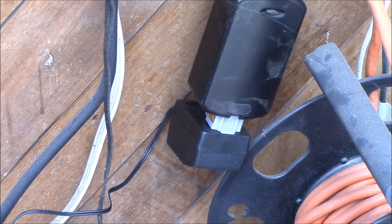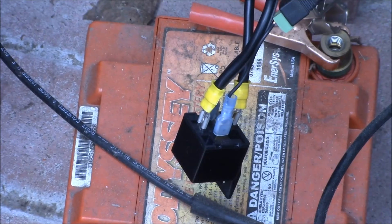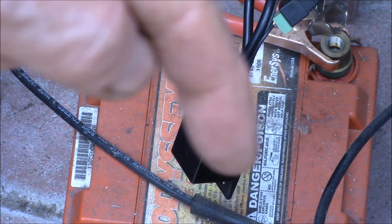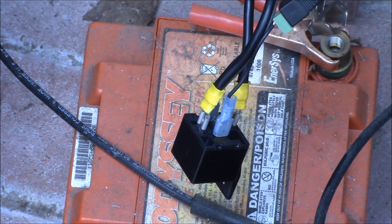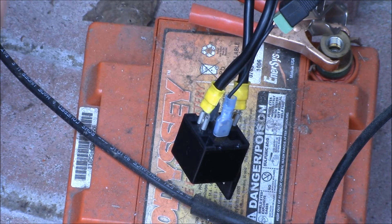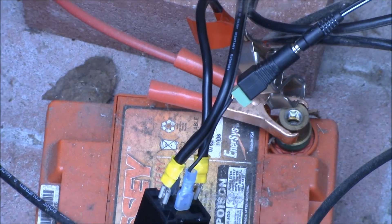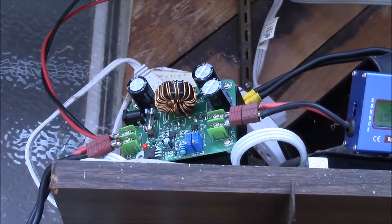Let's see what that little wire coming out of there is plugged into. I plug that 12-volt wire into this little headlight relay — 12 volts goes to the coil, that's the 85 and 86 terminals. And then I have the 30 and 87 terminals: 30 comes from the battery positive, 87 goes out this heavy 10-gauge wire there out the top.